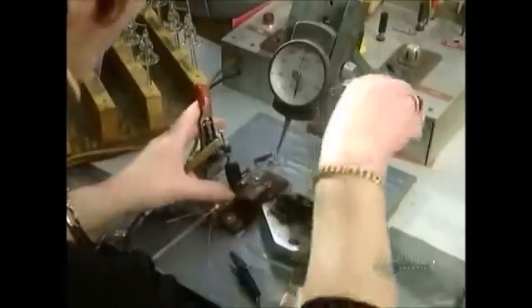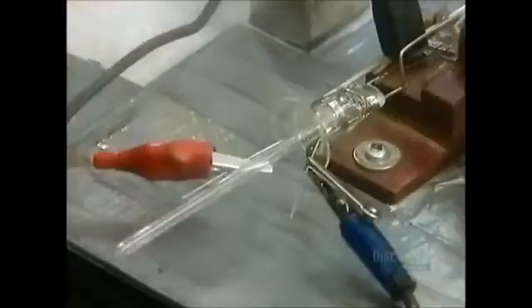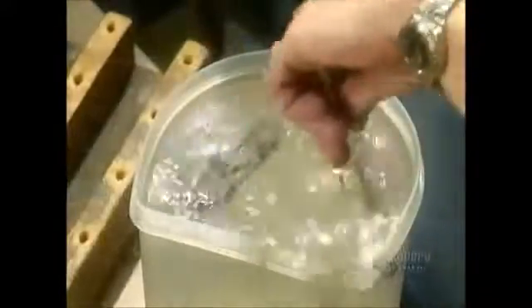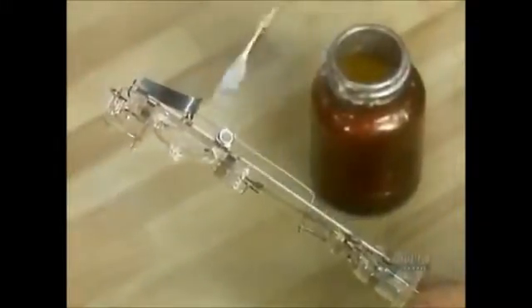Next, they apply a specific amount of pressure to the bi-metal switch to calibrate it. They submerge the finished mount in alcohol to remove any dust or other contaminants, let it dry for 10 minutes, then apply a liquid called zirconium getter, which draws moisture away from the filament.